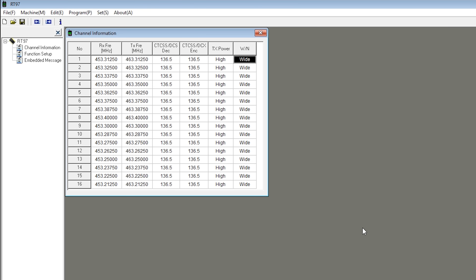That's a look inside the RT97 10-watt analogue portable repeater. I'm actually quite impressed with the build quality — it's nice to see that it's not just a couple of cheap handhelds bunged into a box. It actually has a quality notch filter cavity and a dedicated transmit and receive board, so overall it's a pretty useful piece of kit. The next video on this product will be taking it out, deploying it somewhere, and getting a couple of friends to see how well it works in use. If you like this video please subscribe, hit the bell button, and take care.